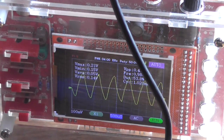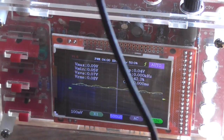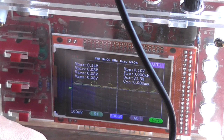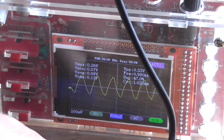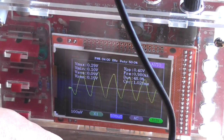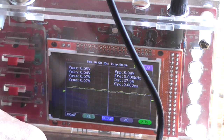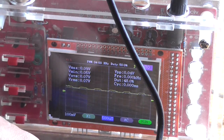Yeah, I just disconnected the input lead from the board. I'll plug it back in. Well, that is kind of interesting. The operation's a little bit different. Unplugged again. Control works a bit differently, but it still doesn't have much range. Temporarily lifted the input's ground connection. Now we've got square wave distortion. No, it's not making that much difference to the circuit. Okay, well, it was worth a try.